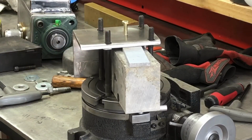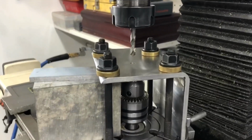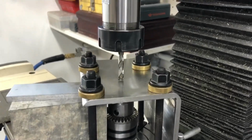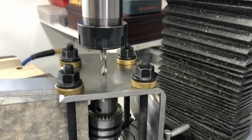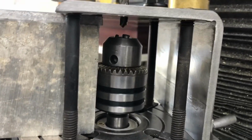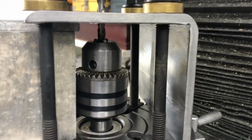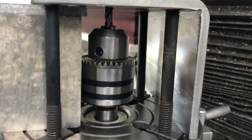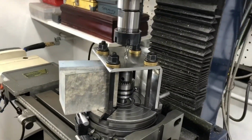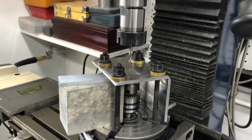Yahoo! I'll get back later. Okay guys, so here it is. What I've done is I put the drill into the mill now and lined it up until it just slips through there without touching. And then if I keep going, it goes right through the chuck too without touching. Close enough for government work, baby. Now I put a mill in there and cut a big circle.